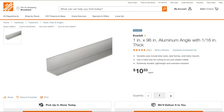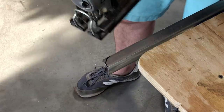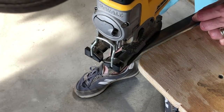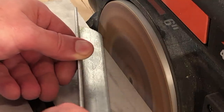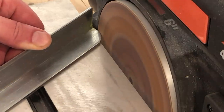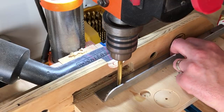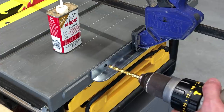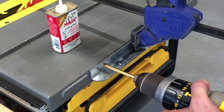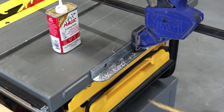As advertised, I'm very excited about this — it actually worked. I start with a piece of angle iron, but you don't need 96 inches, just a foot. However you need to — hacksaw or rotary cutter — cut yourself off a foot. Then I drew out some corners, used a metal cutting blade on my jigsaw, and smoothed them out on my sander. I had not really worked with much aluminum and it was all much easier than I thought — it's like wood but with worse splinters. On the drill press I drilled two semi-random holes, one on each side, then clamped it to my table saw and drilled right through those holes.